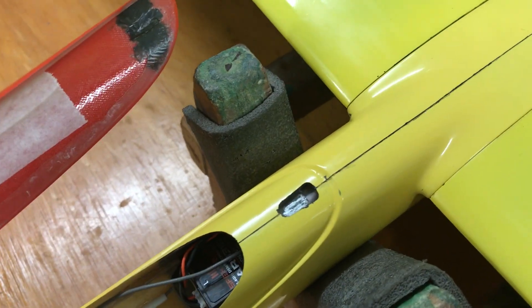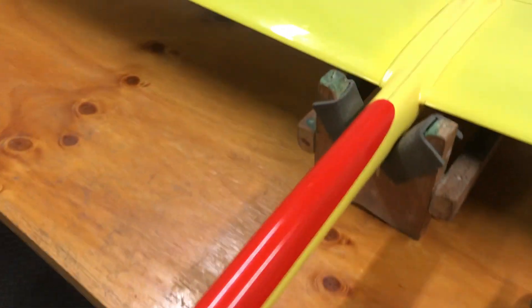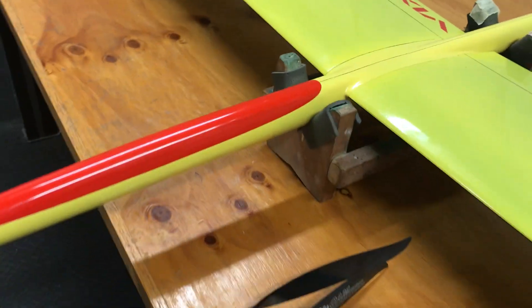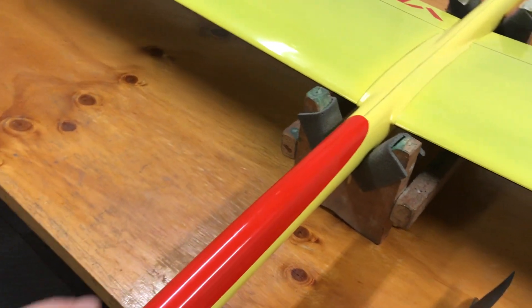I manufactured a retention piece out of G10, glued it in, and it fits underneath that lip. I've got a magnet in the back hole and a piece of wire underneath it, so I hook it in under the front and it snaps into place at the back. Whether it holds or not I don't know yet — I haven't flown the plane yet.